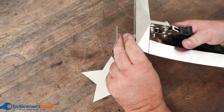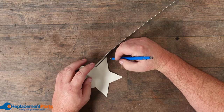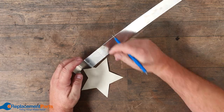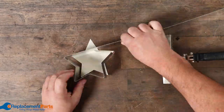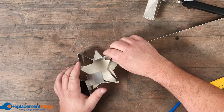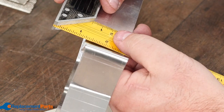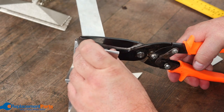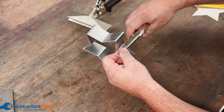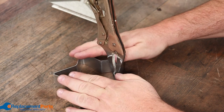We're now marked for our next bend. I'm just bending it by hand, then we'll go back to our template and repeat the process again and again. Once we're good to go, we set aside about half an inch — same as before — mark and draw all the way across. With our tin snips, cut across on the line. We'll use our vise grips and just pinch one half, double checking that everything is sitting nice and flat.